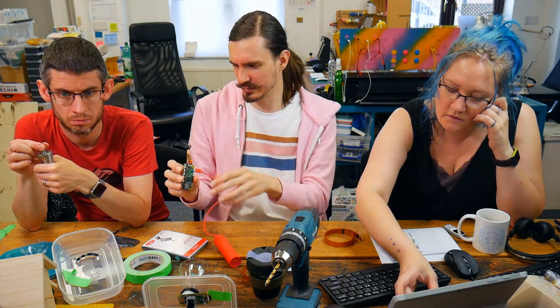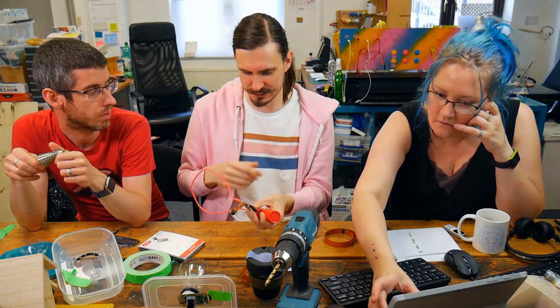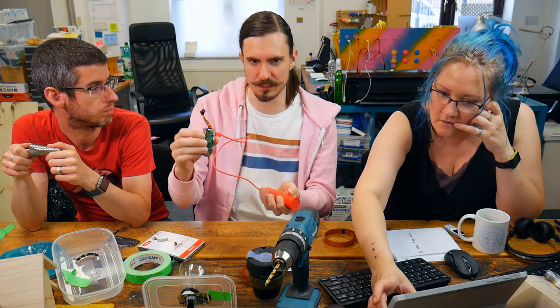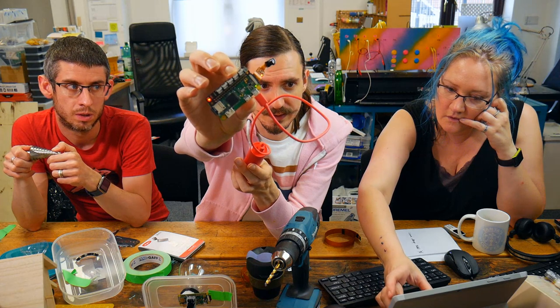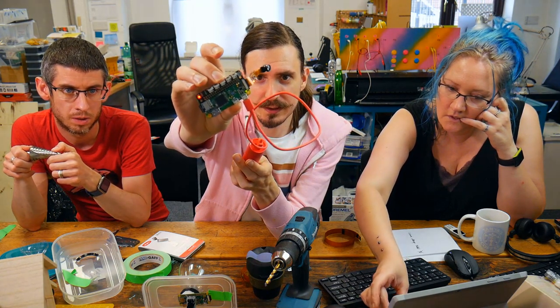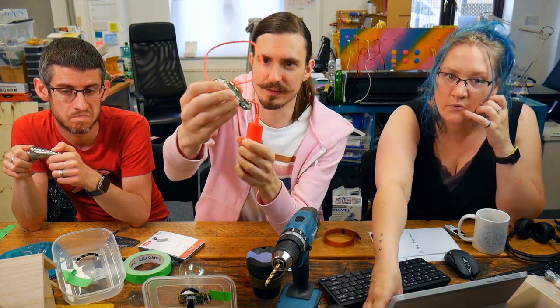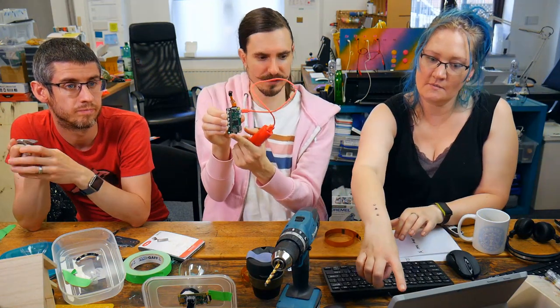And that means that when you're setting it up in a box, you don't have to fiddle about with your mobile phone and load up the web interface and hit the arm thing. You can just hit the B button like so, and hopefully a little LED will light up red to say it's armed, and then when you want to disarm it, press that button, green to show it's disarmed. So that's the beauty of button shim, it has a little LED that can be used for status as well.